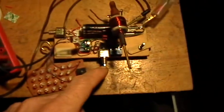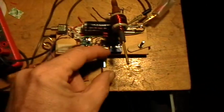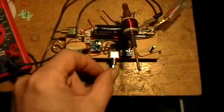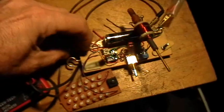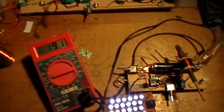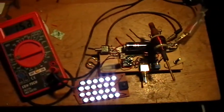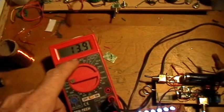This is the ferrite core of the loop stick that I can slide in and out. I can select the completely standard mode or the capacitor-across-the-resistor mode. We'll start in the regular mode — so this is the normal ordinary jewel thief mode with the variable inductor set, and you can see the LEDs are glowing quite brightly with an input current of about 13 or 14 milliamps.